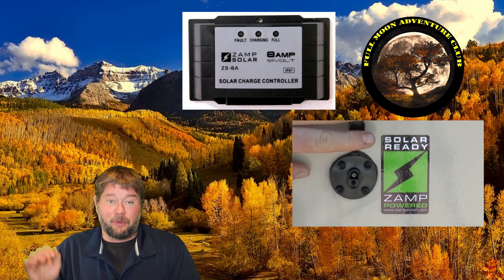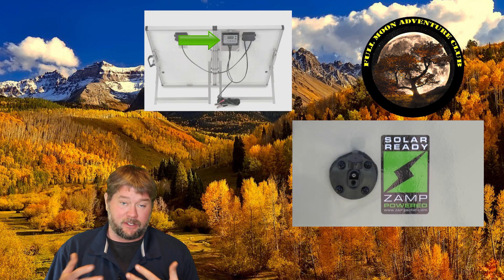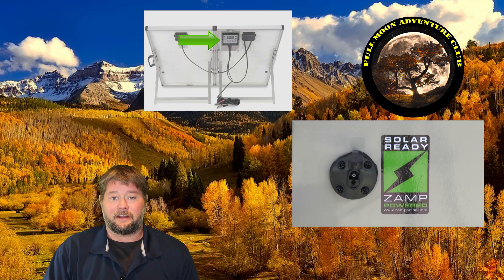These typically do not have a charge controller built into the system, so this is basically just wiring that goes to your battery bank. You cannot hook up just a normal solar panel without a charge controller because it'll keep charging your battery till it's full and then keep charging it and do damage. So you do need a solar kit with a charge controller — in most cases you'll have to check your manual to figure that one out for sure.